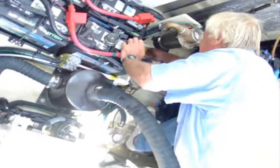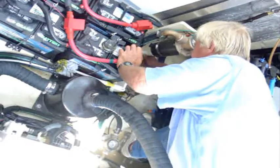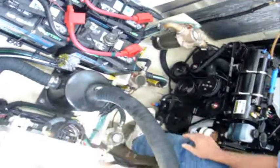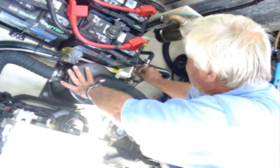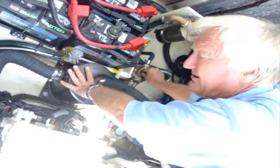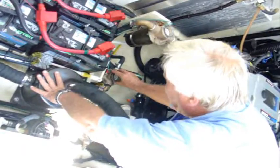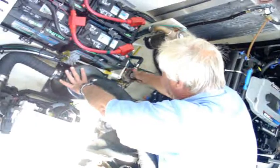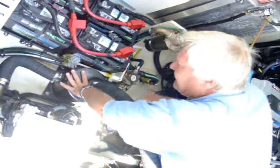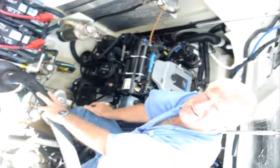Then I'm going to just flush it out a little bit. It's okay, let it go into the bilge — it will get pumped out later. Put my basket back in there. Be sure that it sits down in there firm — there's a little notch in the bottom and it's got to fit in. Then just screw the top back on, and be sure not to cross-thread it. Now I'm ready to open my valve back up, turn my pump on and get my AC running again.